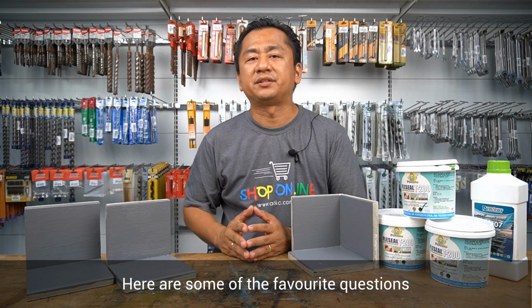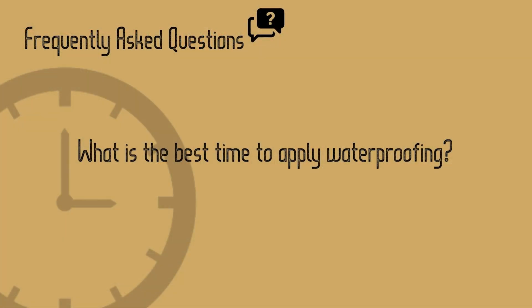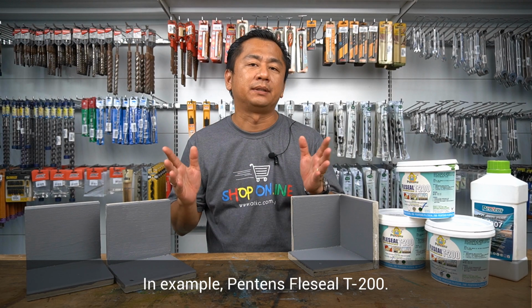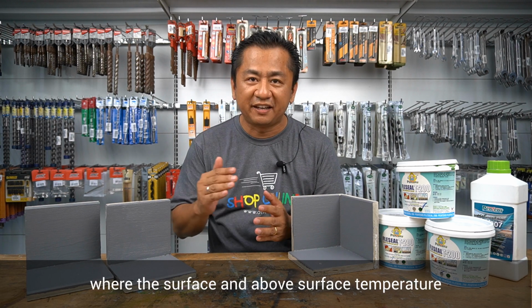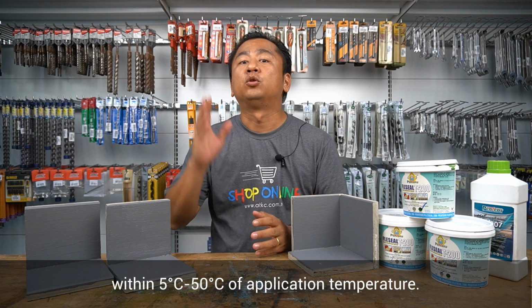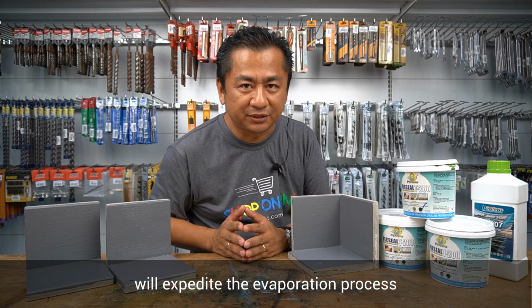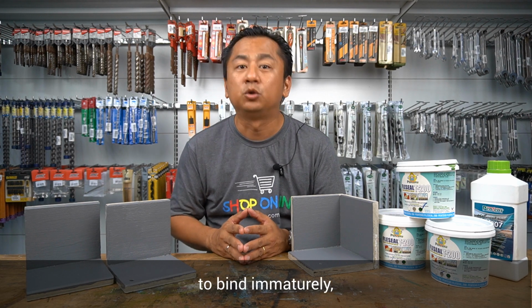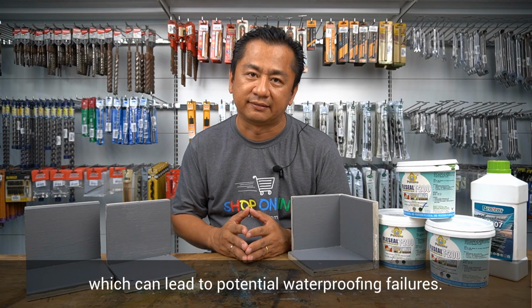Here are some of the favorite questions asked by fellow audience when it comes to waterproofing. What is the best time to apply waterproofing? In example, Pentens FLESEAL T-200. Personally, I would suggest in the morning or late afternoon, where the surface and the above surface temperature are much cooler, within the 5 degree to 50 degree of application temperature. Please remember that high temperature will expedite the evaporation process that will cause the waterproofing to bind immaturely, which can lead to potential waterproofing failures.